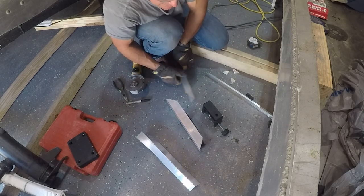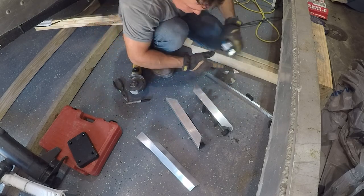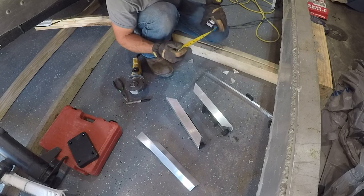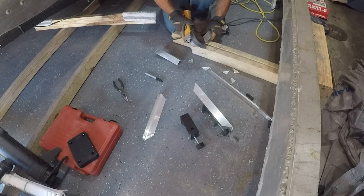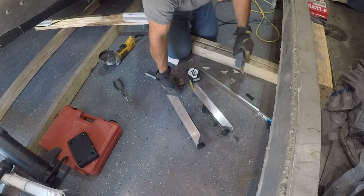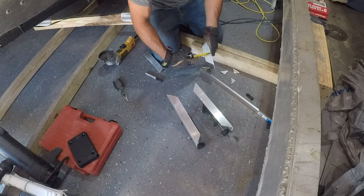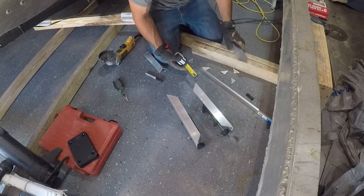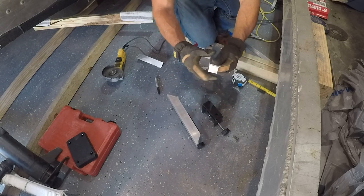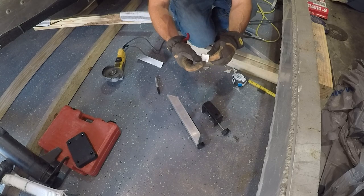I got the angles on these made. As long as that's still seven inches - yeah, I'll just make it seven inches right there. To make this pocket without a weld or anything, we're going to rivet all this together. These are inch and a half pieces, so I'm going to put one at an inch and a quarter. I'm going to take these 1/16th pieces and put them right there on that corner, and rivet through here, then put the other piece on the front side and rivet through there.